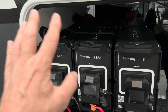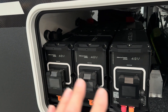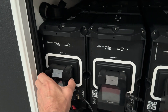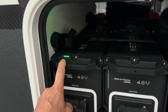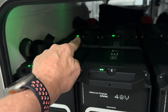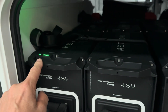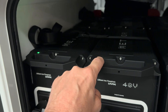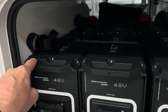The first thing I'm going to show you is that right now it's in dormant storage mode and the batteries are totally turned off. For the user to turn them on, all we do is press this button for one second. The battery comes on and it will then turn on the subsequent batteries. The other three you'll see are coming on here now - they all light up. After they've come online, it goes back to a dormant state with just one flashing LED, using one-fifth of the power that we had previously in our rack-mounted batteries.